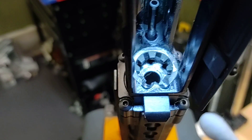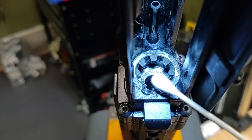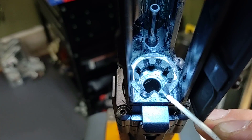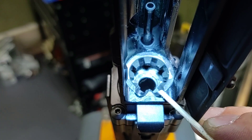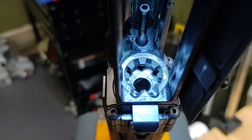To fix this, you don't break out a Dremel and start grinding this all as one piece. You have to take the barrel out of the upper receiver and modify the barrel extension ramps only — the steel ramps. You do not touch the upper receiver ramps. Those are anodized, and when you grind those, you remove the anodizing, which is the harder outer surface. You don't want to do that. Always make modifications to the barrel extension — the steel itself — not the aluminum on the upper receiver.